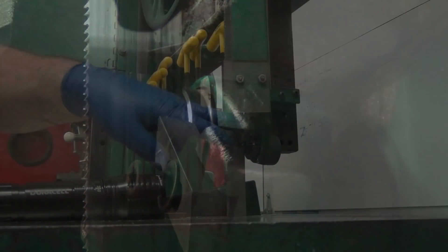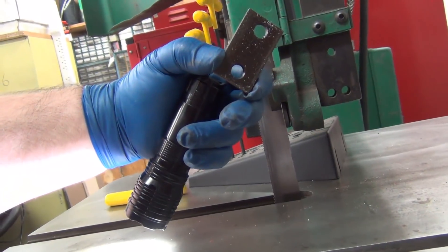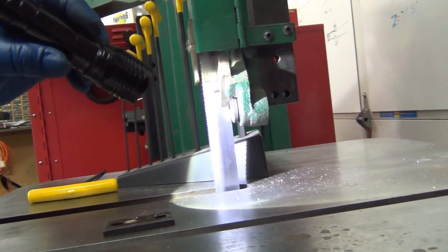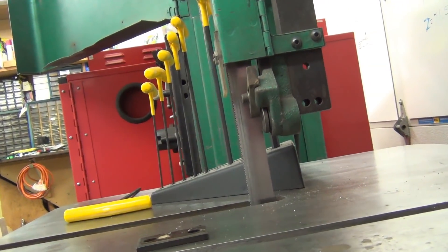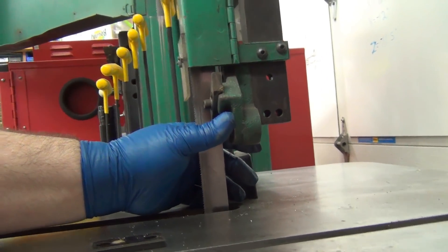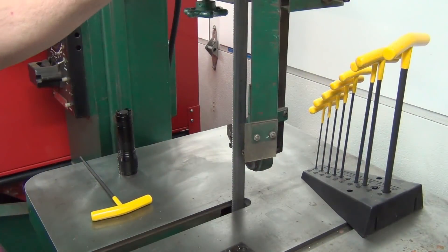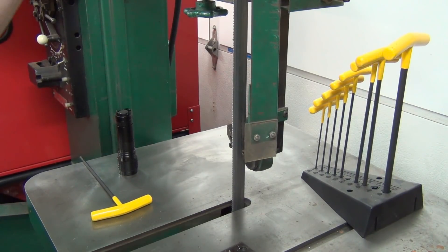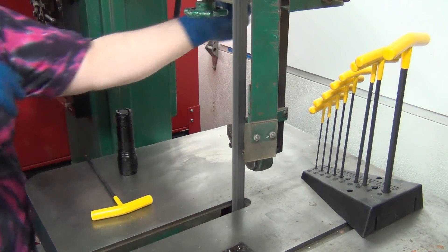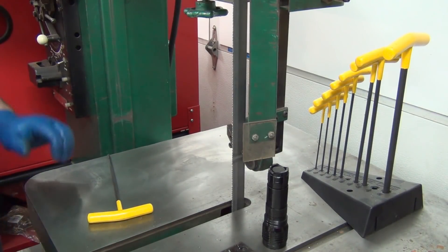It's hitting the top guide. Right between the black and the green right there is where the shim was — that's the 3/16th shim they're talking about that pushes this forward. Using the light really blocks everything out, but it is touching the wheel. From what I've been reading about bandsaws, you really only want it to touch the wheel when you put pressure on it while cutting — not just sitting there running. There's tracking on the back side; I need to bring that forward and make sure it's not being held there by the bearing. The bottom one can't be tracked the same way — it can be taken off and have shims put behind it.